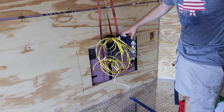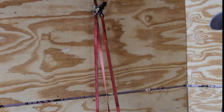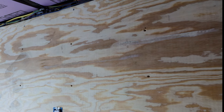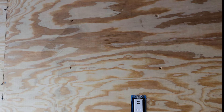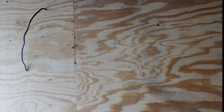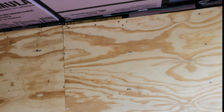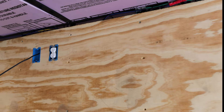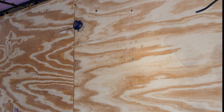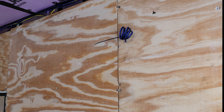We got the wiring done and got all our panels back up. I want to show you a brief overview of how we got the trailer wired and the ways I ran the wiring. Just imagine a cabinet and a wall right here — this is where my breaker panel is going to be. I have all my wires ran through the wall here, both my 12-volt and my 120. At the top, I'll have crown molding to hide all this wiring, but it'll be easy to take that trim off and gain access to any wires if I want to add another circuit. The bulk of my wires run at the very top of the wall, and we just carved the insulation out and ran it down to the receptacle. At the back of the trailer we have two receptacles with USB — that's where our bed lets down so we can charge our phones. Got a 12-volt wire in the middle to run a nightlight or reading light. On the passenger side, we have a simple 110 outlet with coax for a TV mounted up there. Right below, two outlets for a prep table — so if I run an electric knife, a sous vide, or anything for our contest, it'll be right there. Right above it, another 12-volt wire is going to power the under-cabinet lights.